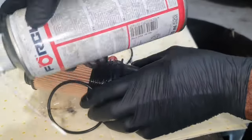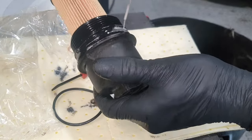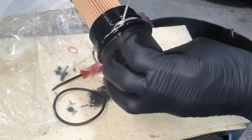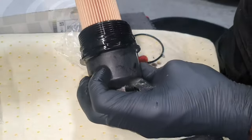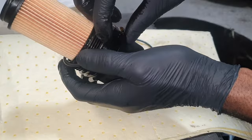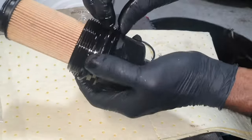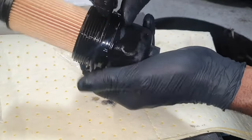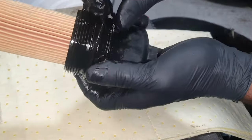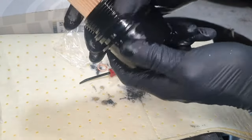I like to give it a clean — it just takes away any dirt and previous residue from the threads or the lining. On top of that, you don't want to put the o-ring back into its seat dry. Get a little splash of oil — maintenance spray is probably not the best because it dries. Get a little splash of oil and run the o-ring back into its place, ensuring it's seated and goes back where it was.